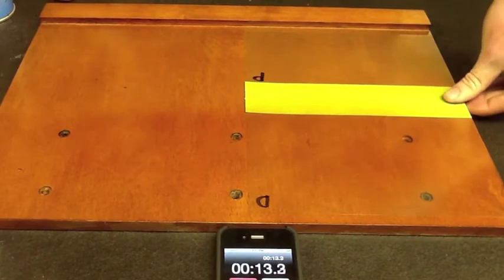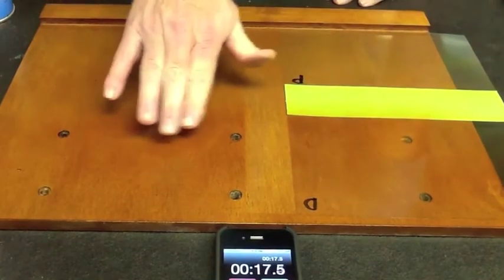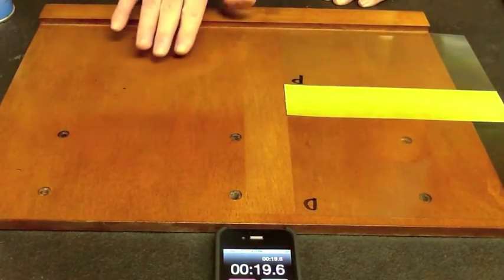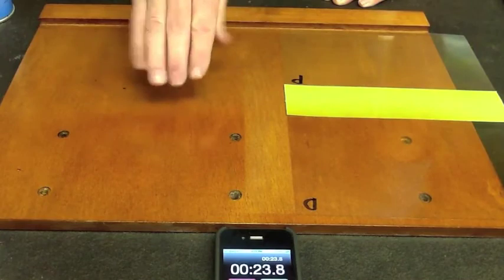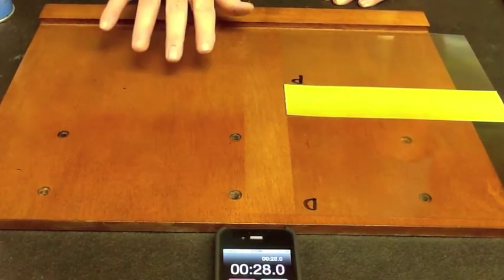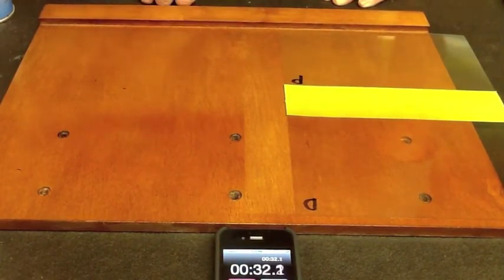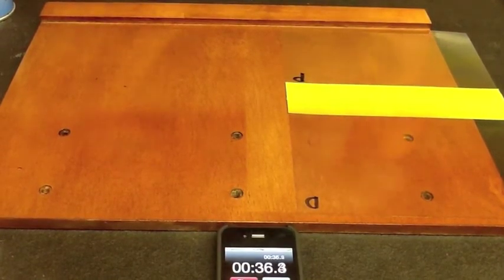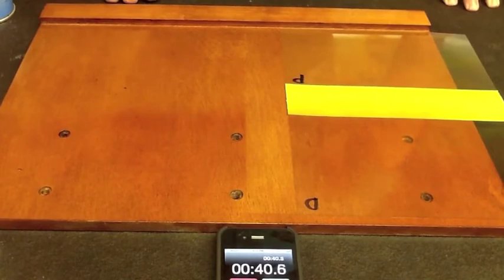I'm going to go ahead and slide this over just a little bit so you can see the effect the dye has on the panel and the pigmented toner has on the panel. The dye again is more translucent. We can see the detail of the grain, where the pigmented coat muddies it just a little bit, obscures a little bit of the background. We're going to pause the video, but we're going to let the timer continue to run. We'll be back in just a few minutes.